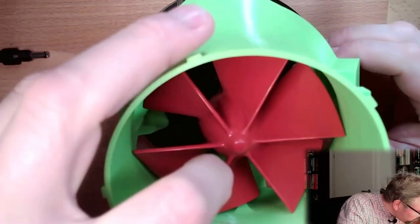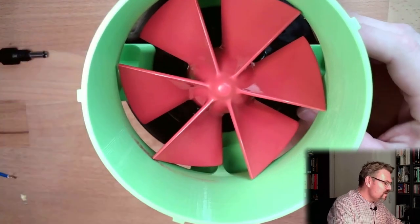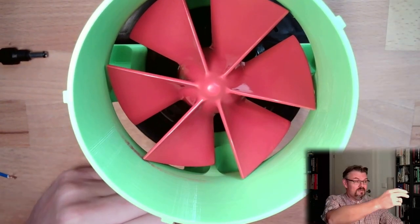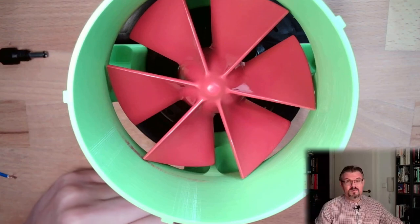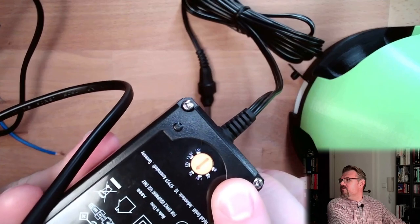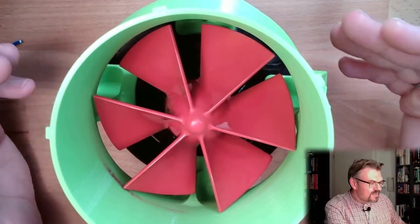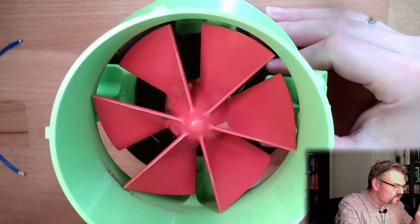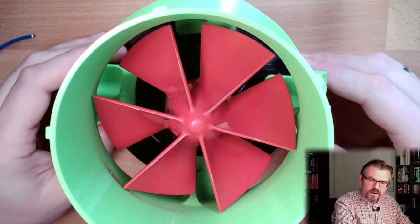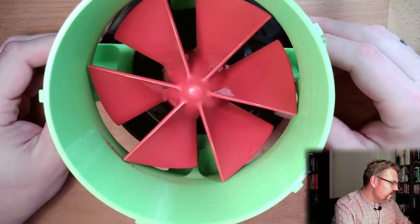And now we have here a little bit more room. Huh? Why didn't it touch the first time? Yeah, this was also because I'm still not confident that we can achieve the ball to float on my airstream. Still not confident. So I've readjusted this from 7.5 volts to 9 volts. And as we know, DC motor, more voltage, more speed. And this is of course also not balanced. It's not exactly balanced because, you know, I spray painted it, and so there are small inaccuracies, and the higher the speed, the more little unbalanced things will lead to wobbling. All right. And so we wobbled more with higher speed. We wobbled more and finally we touched.